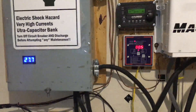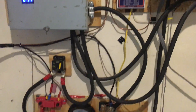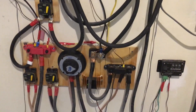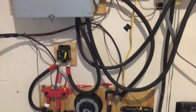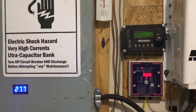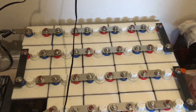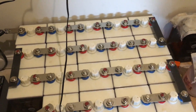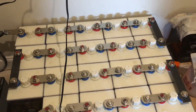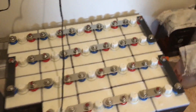The system has evolved from a small DC-coupled setup, then I migrated to an AC-coupled grid-tied / micro grid-tied system, and then came back to a DC-coupled system for convenience and ease of use. I still love the AC-coupled idea, but the problem was when micro grid-tie inverters go bad on the roof and you're getting up in age, that becomes a hassle.